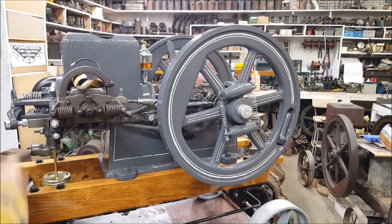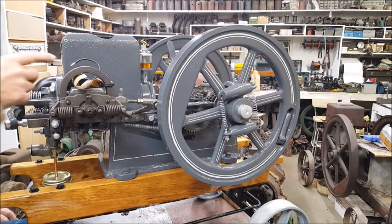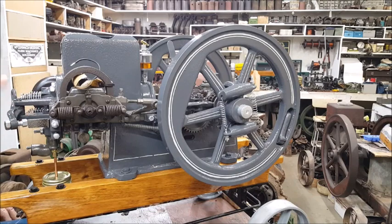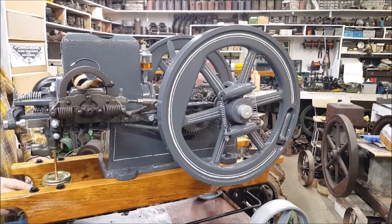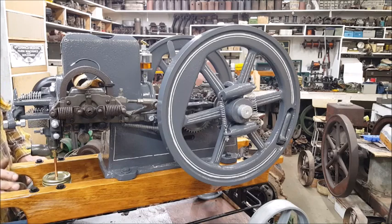You can readily see there that I have the magneto unhooked from the clip. I've turned the engine over a few times and have not been able to get it to start on that magneto. So I'm going to hook it up on the battery and low-tension coil and start the engine up. I have a container here with a check valve on the fuel line right there — that's camp fuel in that jar for a fuel tank. White gas, they call it. It has a shutter on it like that.